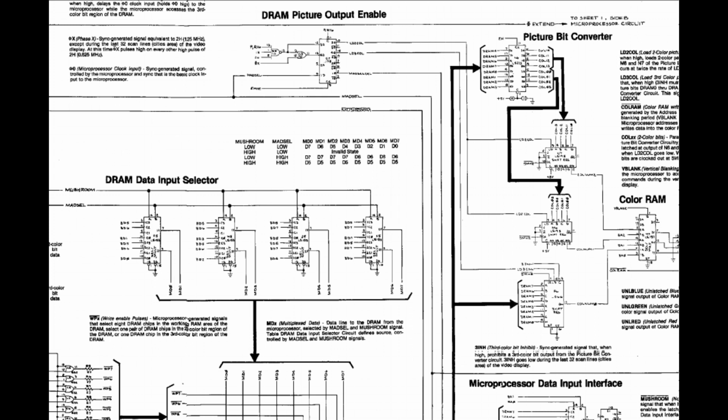The first condition is that there must not be continuous reads from uninitialized RAM. Now, this game's video RAM and the CPU working RAM are just different ranges on the same ICs, so the video generator is continuously reading from the dynamic RAM, but since the CPU is not executing the correct code due to a fault, the video RAM is never initialized, and the hardware comparator just gives absolutely random results. Using it was then a big mistake I made.